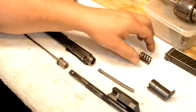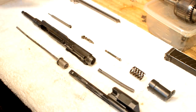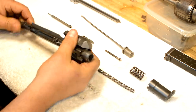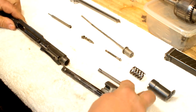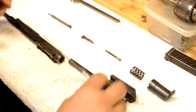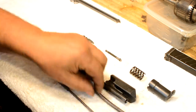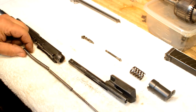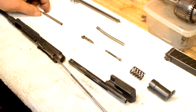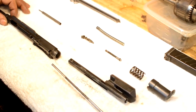Here's the long and the short of it. This formation of parts, as you have seen or will see in the near future, is a Pedersen device. There's a reciprocating mass here that floats back and forth, and there are two springs: a spring that returns this reciprocating mass forward, and a spring that pushes the firing pin forward. These are coaxial springs, and I know you really can't see this in huge detail. Trust me, Bruno is animating this thing, because if you think we're letting a Pedersen device in this shop go floating by lazily, you are wrong.